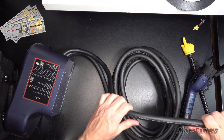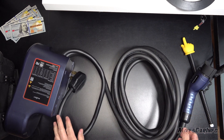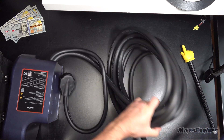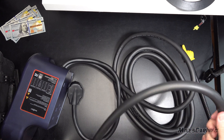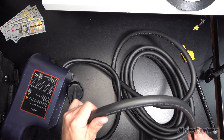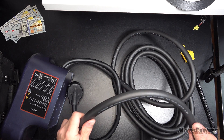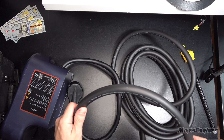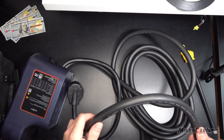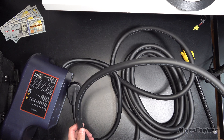Always look at the wire gauge. This is an 8 AWG wire on the short section. Now on the longer section: 2×8 AWG, 1×10 AWG, and a 16 AWG. The 16 AWG is just a data cable, so it's not a big deal. The main thing is that it has the 8 AWG and the 10 AWG — the 10 AWG will be your neutral and the 2×8 AWGs would be the actual current cables. That seems good.